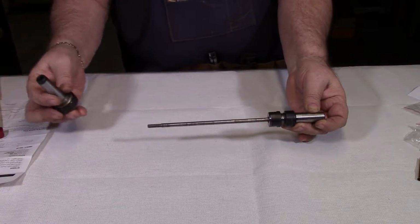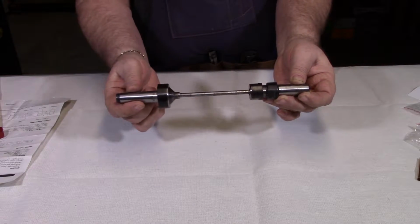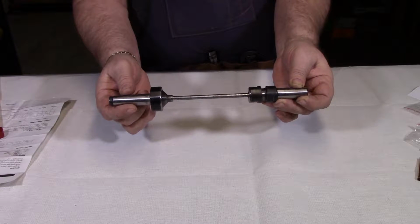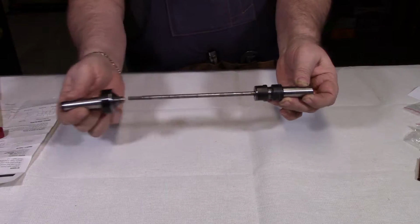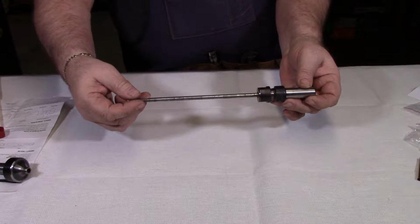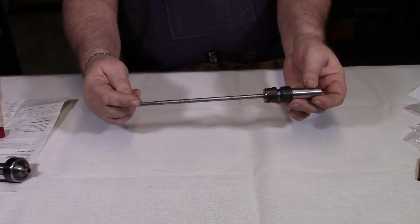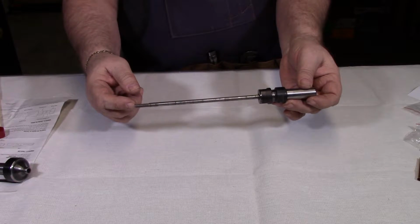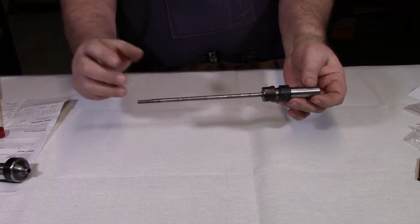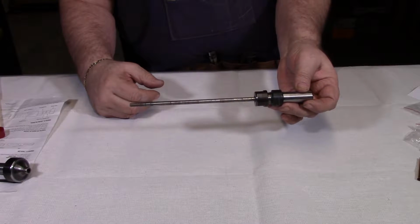Then on the very end, once you've got everything mounted up on the lathe, use this Mandrel Saver, which is infinitely adjustable for the length of your material that you're working with. This saves a lot over the old version, where we used to use a bunch of mandrel spacers and so forth and brass knobs and try to tighten it up to get that snug. And then we'd use the 60-degree conical thing in the tailstock. And the problem is if you got too much pressure going on here, you wind up bending your shaft a little bit, which would give you problems about how your parts would match up and wouldn't come out correctly.